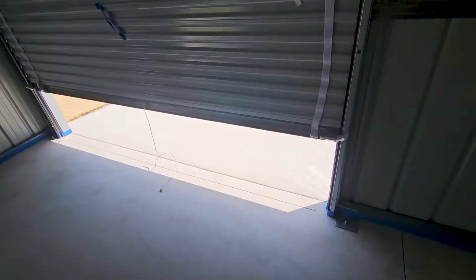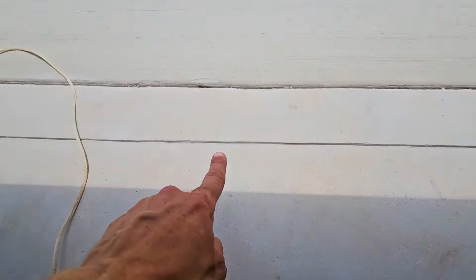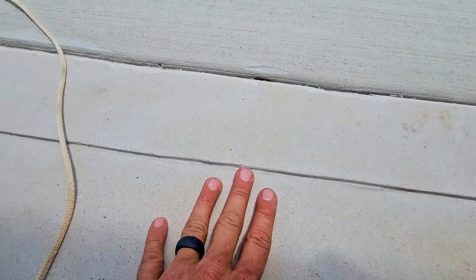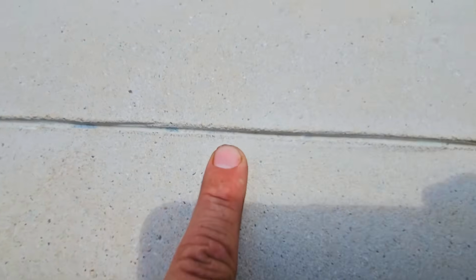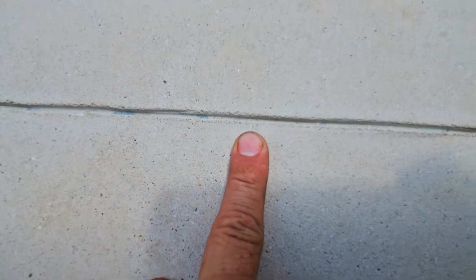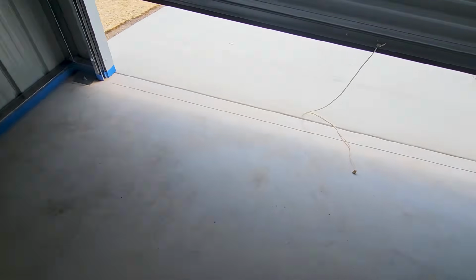What we like to do here is basically we'll drop the floor down. We'll score a line where the rubber meets the outside of the edge, and that's where our epoxy edge is going to end. Concrete out there, concrete in here is going to be with the flake. Epoxy is not UV stable, so you don't want it to extend further out to where the sun's going to hit. So we had 3 transition lines to cut there.